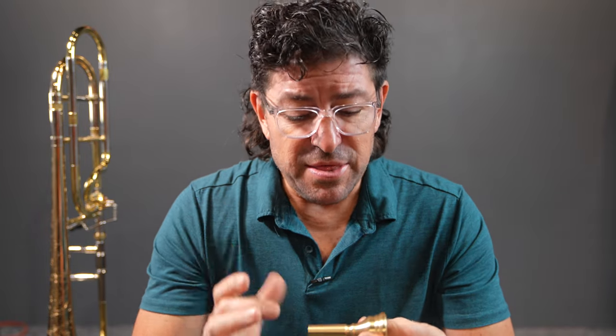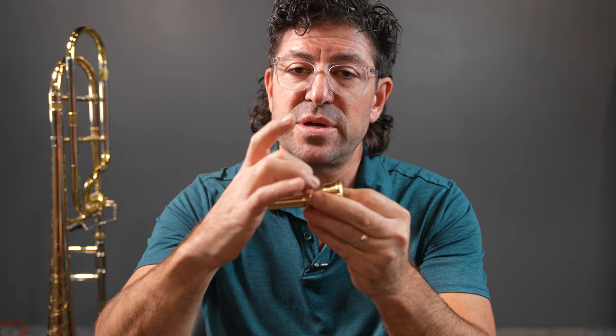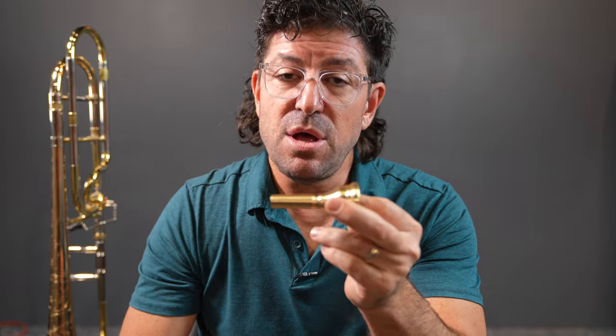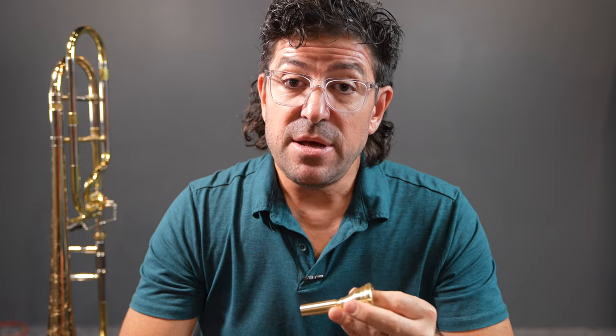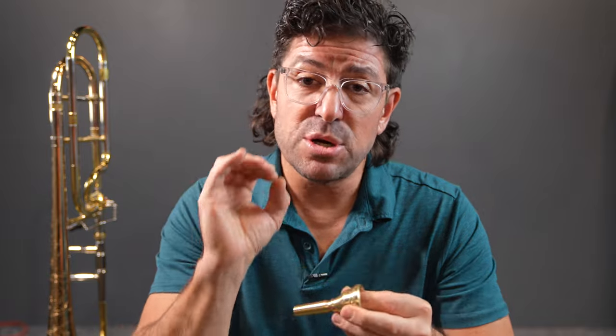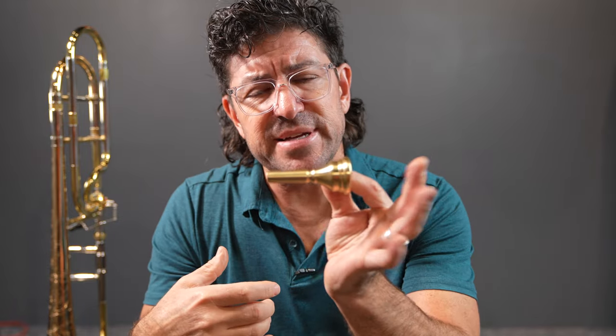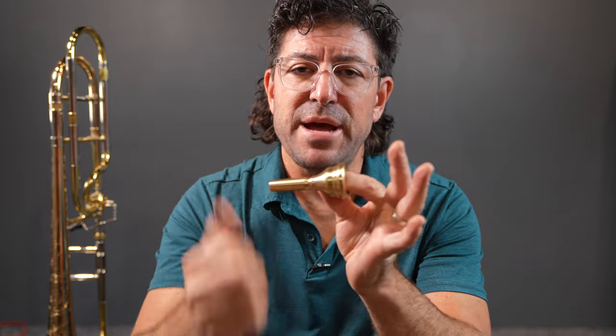But the key thing is when I'm machining it, we do a face and then one tool can do this entire outside profile. On some of my other mouthpieces that I've designed, I have right hand, left hand, and a neutral tool to do all the decorative, sharp, crisp details. And with this, I can use one tool. What does that mean? About 4 to 6 seconds every time the turret indexes and goes to that tool. So I'm saving probably 30 to 40 seconds by not having to go to these other two or three tools. I can do this complete in one pass.